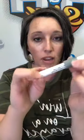So you're going to take your pen, I'm using the fine point, and you want to choose the collet that slides on there easily. In my case, it's the gray one, which is the large. It can slide all the way up that pen. And you're going to take your collet and insert it. Now, this end cap is there so you know how far to stop your pen.